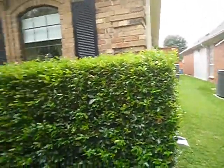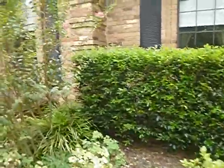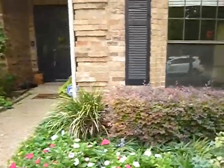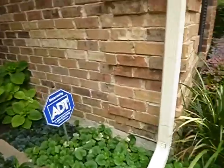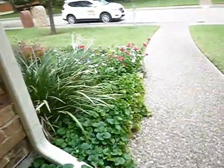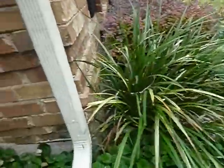Moving around the front of the house now. We are. Wood mulch next to the house, bushes next to the house. Trees too close to the house. Let's see if I can get a good example here. Oh, one is a good example. I'm not getting one. Okay. Right, here's one. You know, it's a post-tension slab house because you got an exposed post-tension end right there.